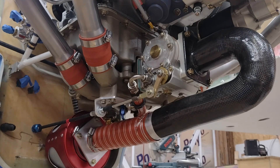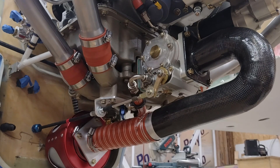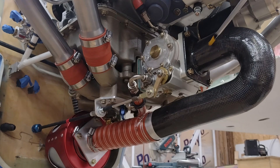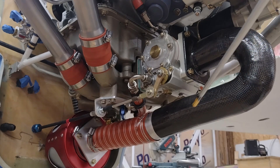This dash-4 on the Silverhawk — this quarter inch outlet that goes up to the fuel spider — can either be on the bottom or on the top, so you can configure this thing and mount it any way you want, but it's a matter of how it will fit. With this outlet either being on top or on the bottom and the sniffle valve, it just was not going to physically fit. So I really had no option — I was driven to mount this fuel injection servo facing completely aft, and that drove the requirements and the design of this 180 degree air induction tube.